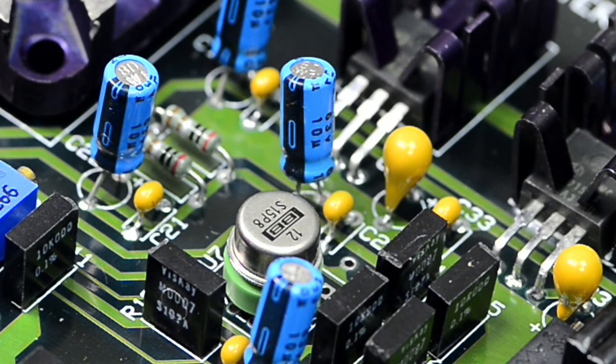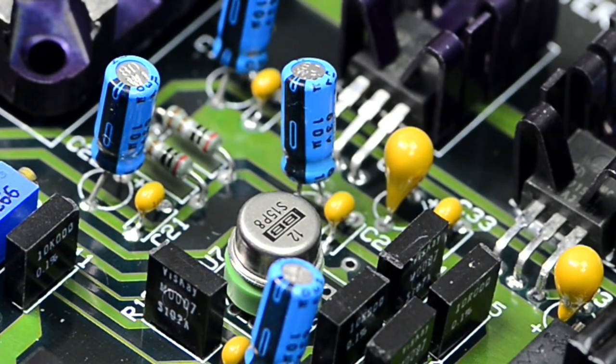So this big opamp has a TO-3 package, gain bandwidth product 1.3 megahertz, output current per channel 5 amps, and bias current 50 picoamps. So it has a maximum voltage of 50 volts. So that's what is used here in the bridge. Very nice opamp. And yes, they have opamps that go up to like 1000 volts, and also opamps that go like 30 amps, I believe. And those cost well over $1000 for one opamp. So they also have very nice big packages, for the thermal conduction and everything.